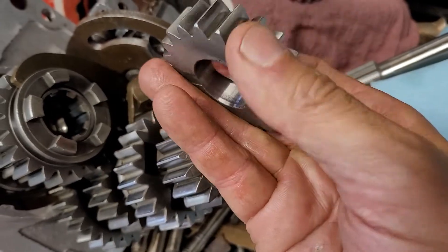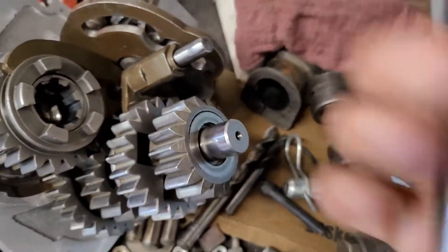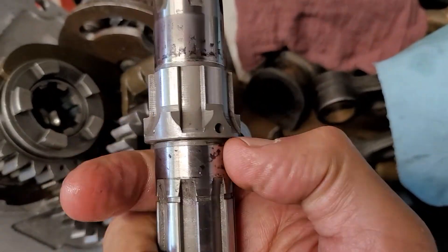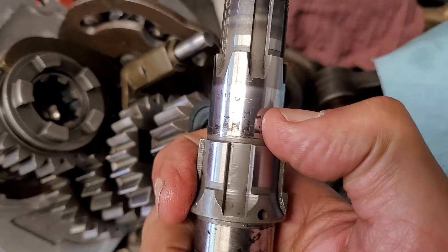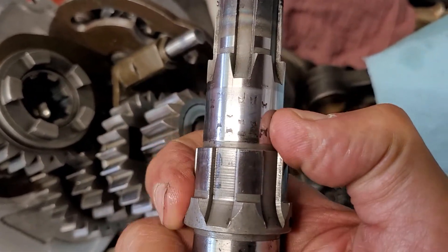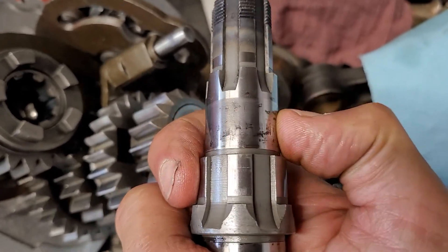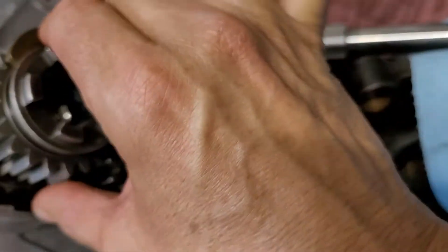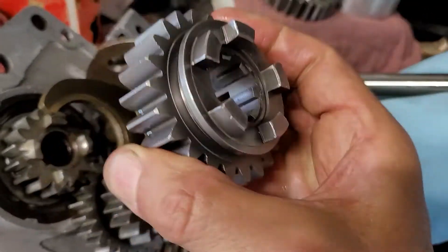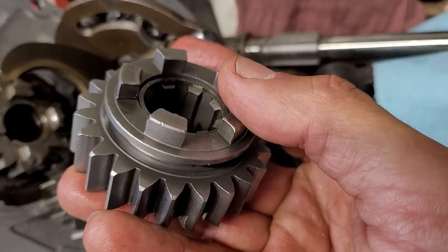The gear itself isn't bad but it's a little hammered. The shaft has had some water in it — there's corrosion here, bad rust pitting here, you can feel it with your finger, it's nasty. There's no way a needle bearing would have survived on this. It would have eventually started chipping the chrome or hard plating and come apart.